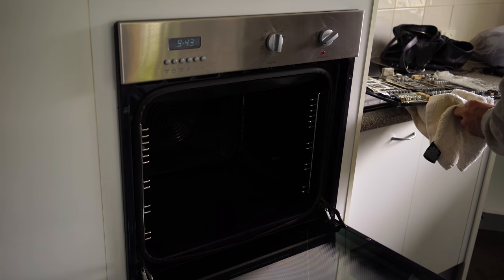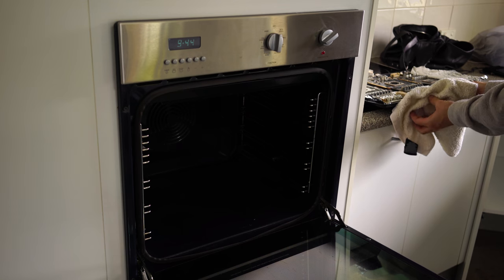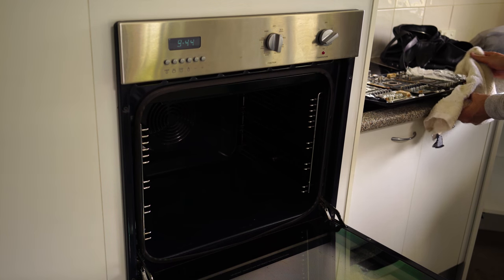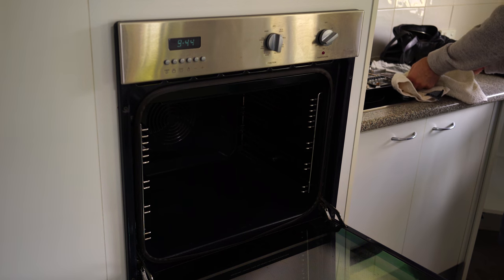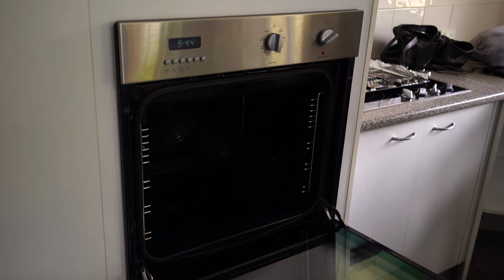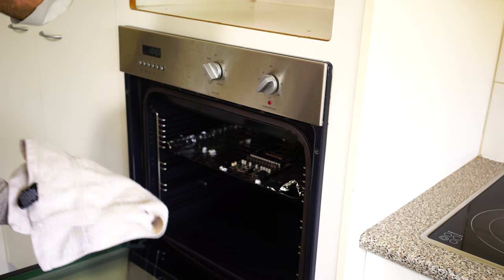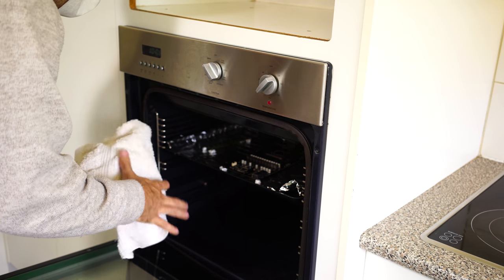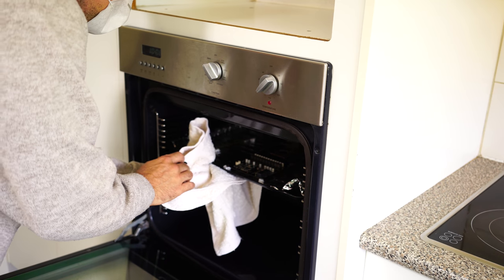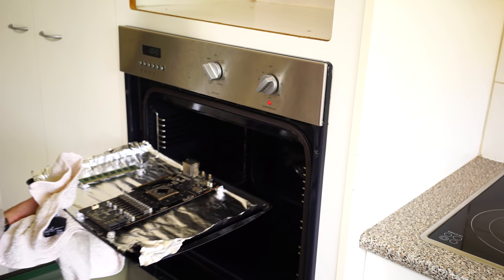So I did follow a guide where someone said they got their oven baked card fixed. So I followed that guy to a T because I've tried this in the past and it just hasn't worked. But they did come out, all the cards did come out looking pretty good. It looked like the solder had reflowed. So we'll see if that fixes the problem, but I did suspect that at least on two of the cards, the memory was the problem. So if you had a bad memory chip, I don't think oven baking that would bring it back to life. But hopefully some of these other cards here will work.